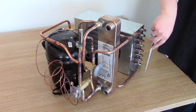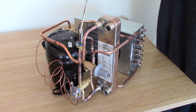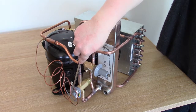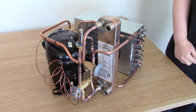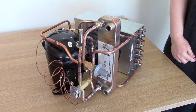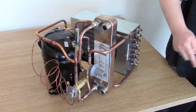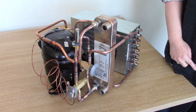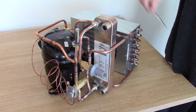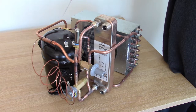From the bottom of the condenser, the liquid refrigerant flows through a filter dryer, a solenoid valve and a thermostatic expansion valve, where the high-pressure refrigerant turns into a cooler, lower-pressure liquid. As the refrigerant enters the evaporator, heat energy is exchanged from our customer's application fluid to the refrigerant. This causes the refrigerant's state to change into a low-pressure vapour before it leaves the evaporator and returns back to the suction line of the compressor.